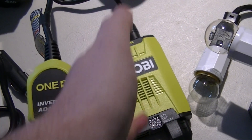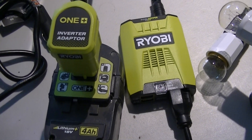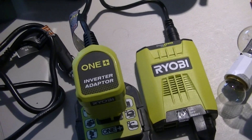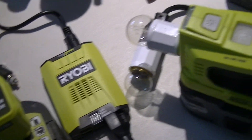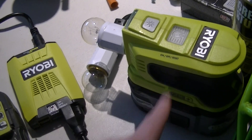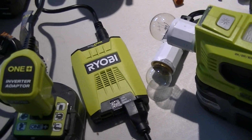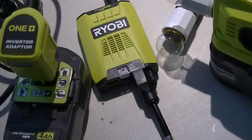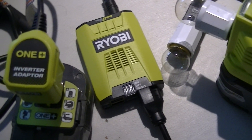These inverters will work with those higher-potential systems which are 12-volt-only inverters may not be happy with. Of course the problem with this one is you have this extra fiddle-dingus thing which can get lost on you. But they both work for their respective purposes — I use this one a lot for work lights and stuff. This one I hook up to charge stuff with USB ports and they'll charge perfectly happy. Yeah, just a short video on these things.